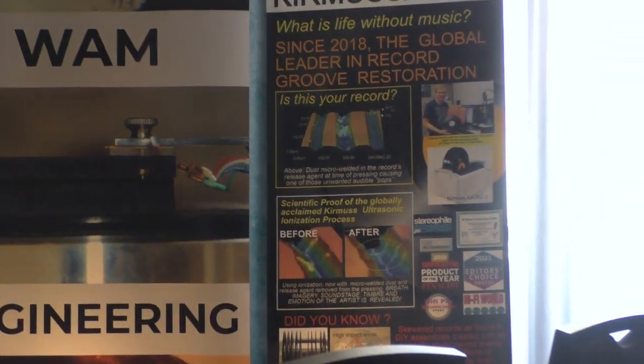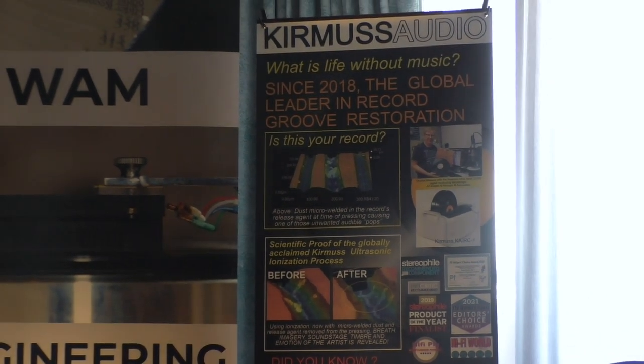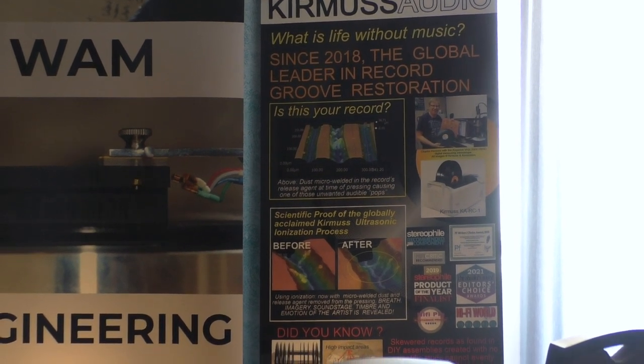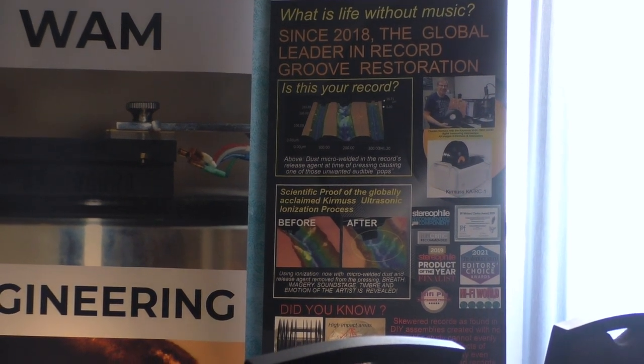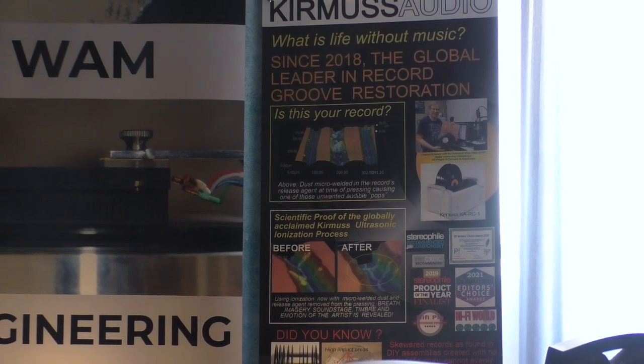And if you're running the pump, which these guys do in their bubblers, as I call them, it negates cavitation. You cannot have moving water in an ultrasonic bath. You can't. So you cannot filter when an ultrasonic is running, because you will negate the cavitation.